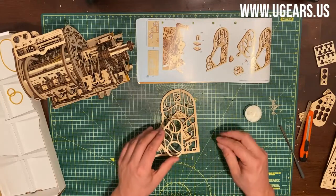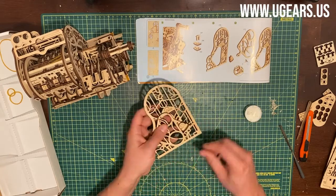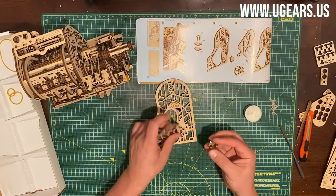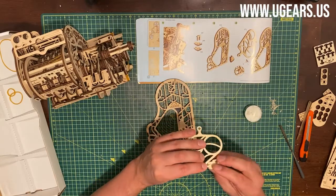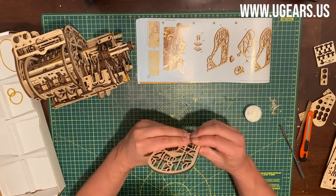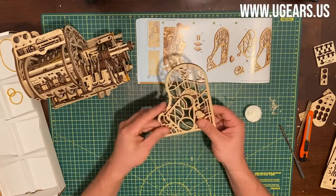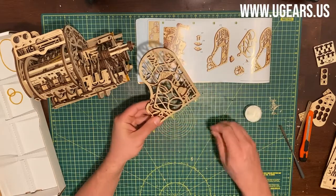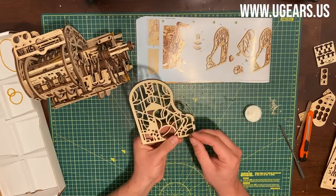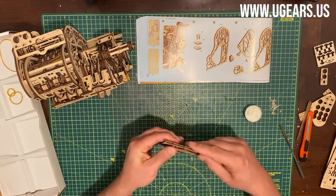So this piece, 181, round off piece goes right behind the lug, and then the 6 goes in here. So I'll pull the lug out a little bit, actually makes it easier. Put 171 through this hole right here. That would be much easier than squeezing it in. Then put the lug back on. Rotate a little bit that part, and then 161, I'm gonna lock it from the back. Not from the front.